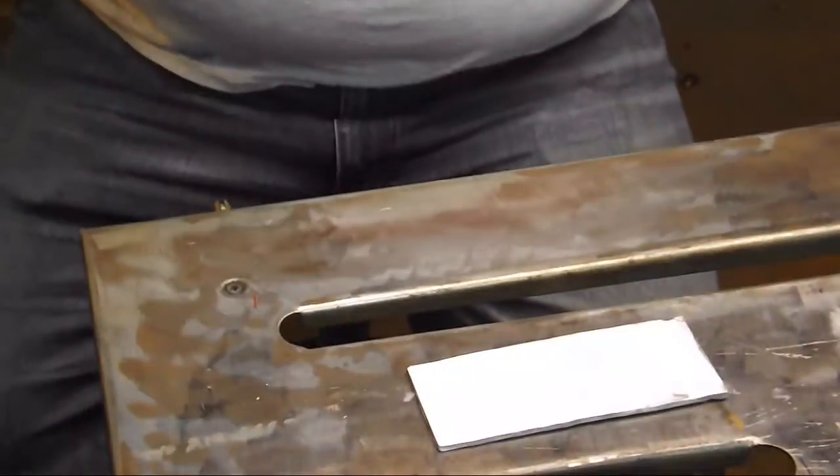There you see it in all of its ugly glory — the crater crack. You can see that because the material is below the surface, when it cooled due to thermal contraction it just pulled itself apart from the center. This is what happens if you don't add enough filler material at the end of your weld.